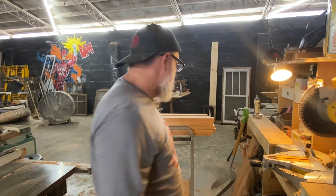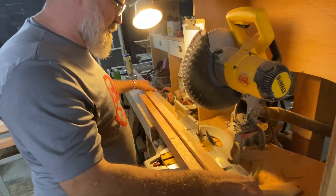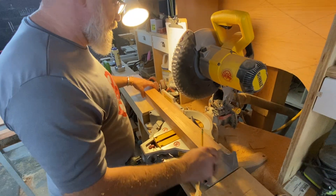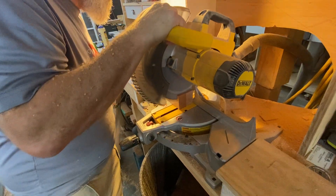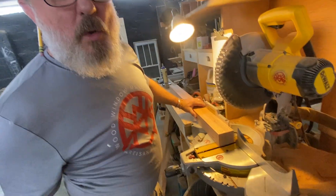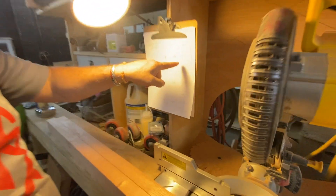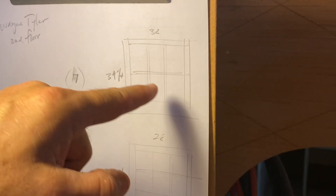I'm going to show you how to place the mortise holes in the stiles. First thing is finding your best faces — I'm going to put the best faces together, and that'll square up my end. So what I'm doing is laying out this piece and that piece. These are my stiles.